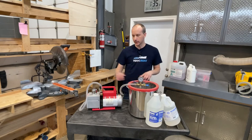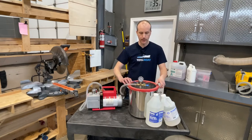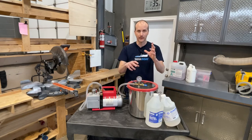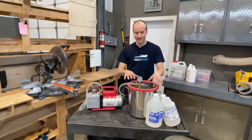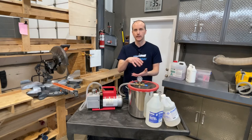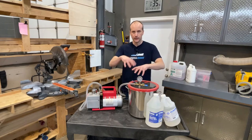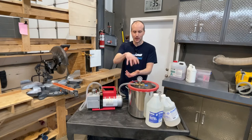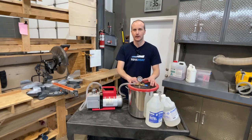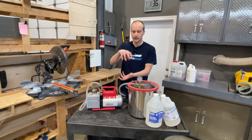For example, Alumilite's ClearCast Slow product — you'd mix it in a container, put it in the vacuum chamber, and turn on the vacuum pump. Through the clear lid you'd see that liquid mixture turn into a bubbly mess as air is sucked out. One thing to keep in mind when degassing: do not put your material in a cup that's too short. As the air leaves and bubbles up, you get something like a root beer float — a big mound of air and liquid. Make sure your cup is large enough to accommodate the rising material during the degassing process.